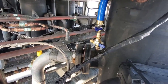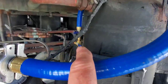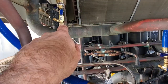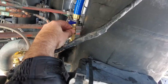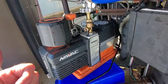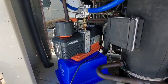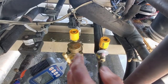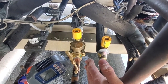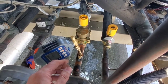Now we have gone straight from the suction side and the discharge side of the system straight to the pump with large diameter hoses. The cores have been removed to eliminate restrictions, and we've applied nylog to the fittings to keep a good seal as we pull a vacuum. We want to open up these ball valves. We have utilized solenoid magnets on the liquid line and hot gas bypass solenoid to open the system wide — I suggest you guys do this, or you can have problems getting all the contaminants out. We have our micron gauge mounted with the coupling so the micron gauge is upright.